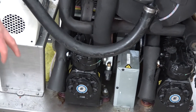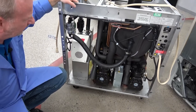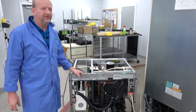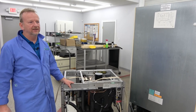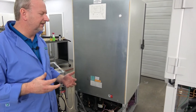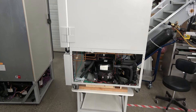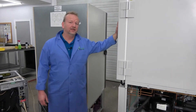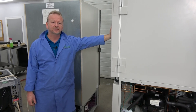We don't want any rust or moisture dropping down and causing corrosion on the machine. We've been doing this for a long time and are very adamant about getting these systems working well and back to manufacturer specifications. This is a simple video to build your confidence in knowing what we're doing with these machines — they could be working fine, but we're still pulling panels off, looking, testing, making sure there are no future problems, putting in brand new batteries, new air filters over the condenser, and really thoroughly going over everything. If you have any questions about our ultra-low freezers, freeze dryers, or other ultra-low equipment, don't hesitate to give us a call. Thank you for watching.